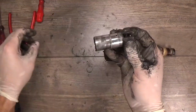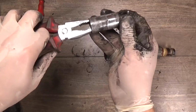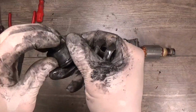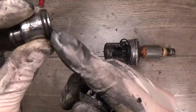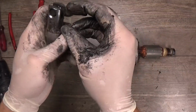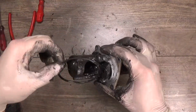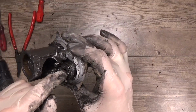Taking out the aluminum cylinder, and we want to see how the striker looks. Okay, we have compression. The O-ring looks not flattened, looks good. It's a green one, genuine Hitachi O-ring. Of course, we have the pin striker, so this part looks good. The O-ring. We have the bearing inside here.